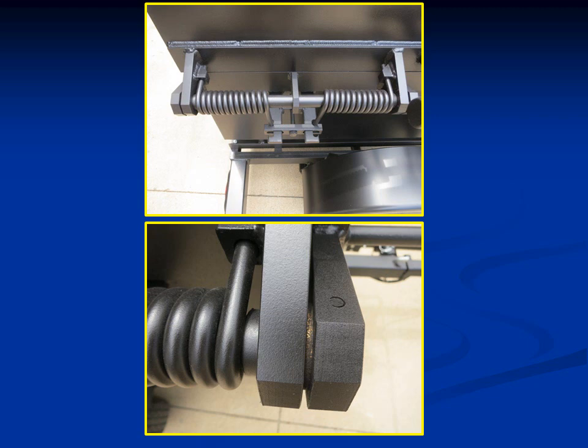Now one thing we had to come up with in our design is our patented torsion spring lifting system for the lid. As you can imagine, of course, the steel is heavy and the ceramic insulation is very dense and very heavy also. So the actual lifting force for the handle without this spring system would be 134 pounds. Well, no one's going to lift that.